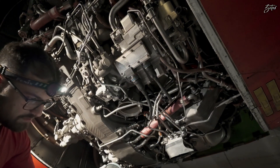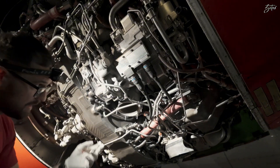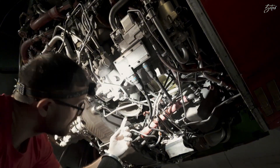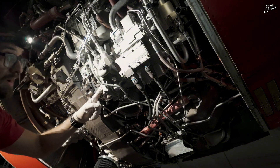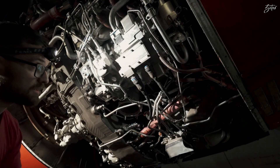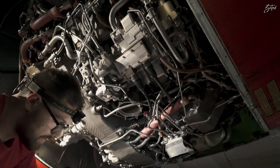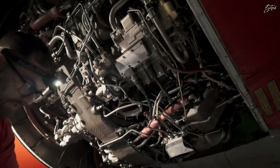Since the fuel comes from the outside from the fuel tanks, it gets through the filter and then through the middle inside towards the high pressure pump, and then it enters into the HMU and then it's delivered to all the valves and of course to the fuel nozzles. Now we need to inspect the filter.